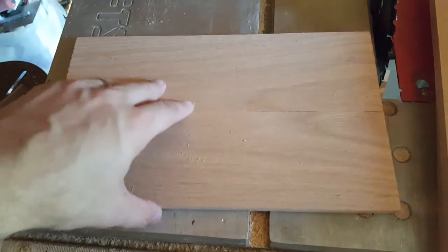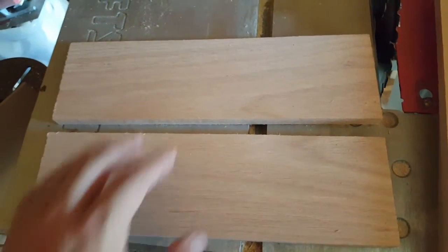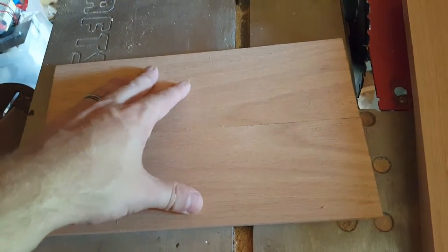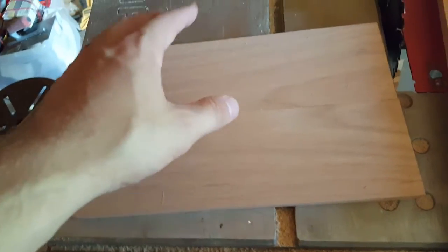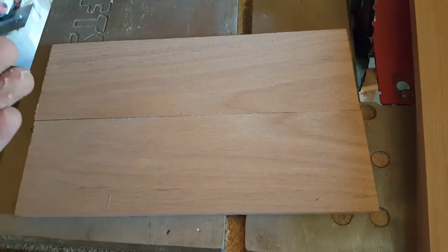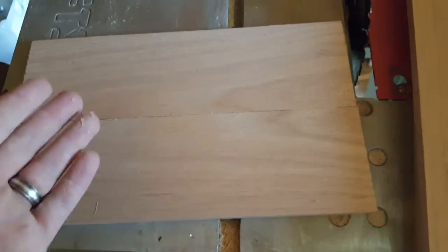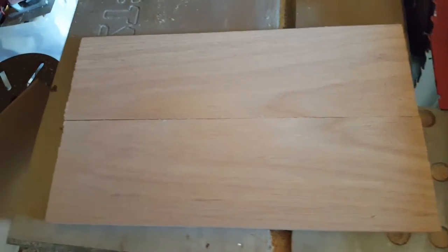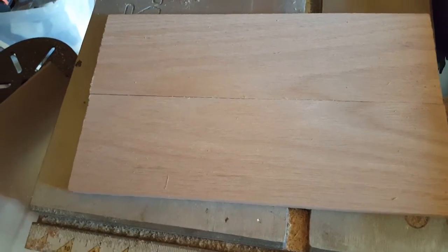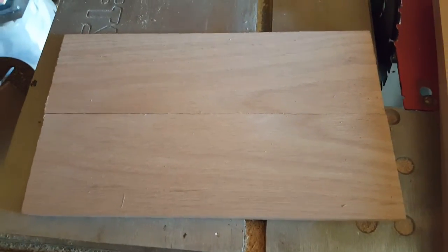If you get half-inch wood, you get these what they call hobby boards. You can pick these up at big box stores, any type of lumber yard or something. But typically there are two issues. One, they come typically around two to four feet long, and we need these 12 inches wide. The issue is when you cut a board, you lose whatever the saw's width is. So you might think you can use one four-foot board for four 12-inch pieces — but no, you can't, because you'll lose too much. By the time you get to that fourth one, you're not going to be at 12 inches. You'll get three good 12-inch cuts, but you won't get that fourth one out of it.